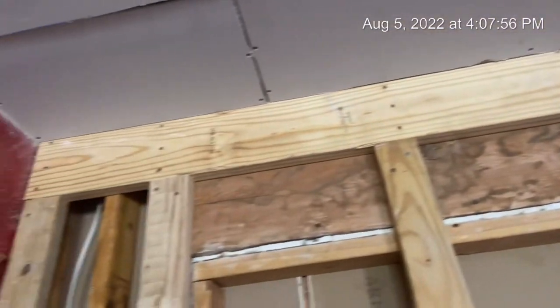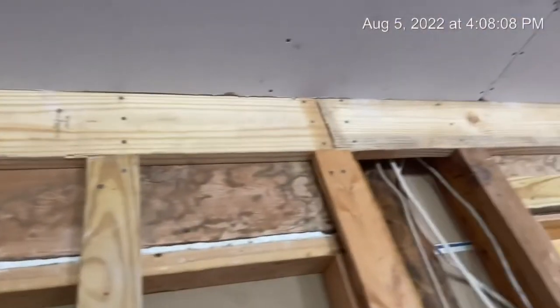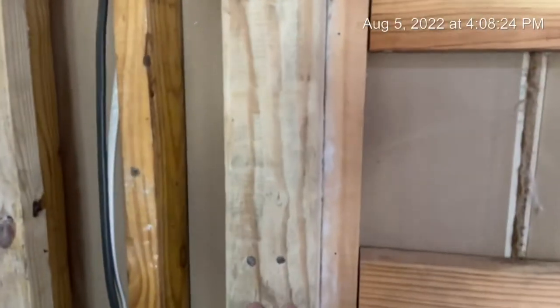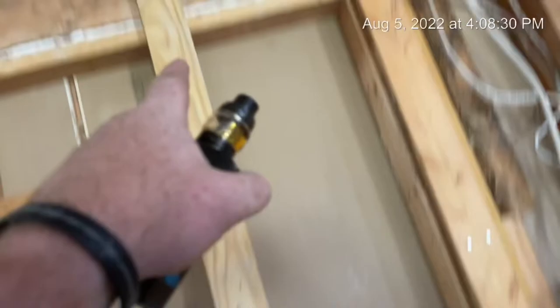All right, this is what it looks like when it's all done. I'm going to run all the way to the end and put the sheetrock up to cover it up. I will have to open the sheetrock back up because I've got to figure out the wiring — it's all kind of goofy. But everywhere there's a stud coming up I put three 16-penny nails, about two feet apart or 16 inches apart on each stud. And when there's two studs doubled up, I put about three screws in each one to keep the boards from bowing out. And that's it for that — now I've got to figure out the wiring.